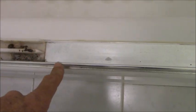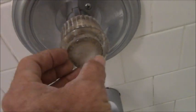So you're going to notice there's a lot of screws where the shower door used to be. That's what the screwdriver is for, the cordless or whatever. You've got to take out all those screws along here. This is the bottom rail. That's only caulked to the top of the tub, so that will come out with a little chisel, get off all the caulking, and that will come right out. And of course, you'll need the screwdriver to get out the plate here. Inside of this, there's another screw. So yeah, the flathead screwdriver, you'll need to take out this overflow cap.